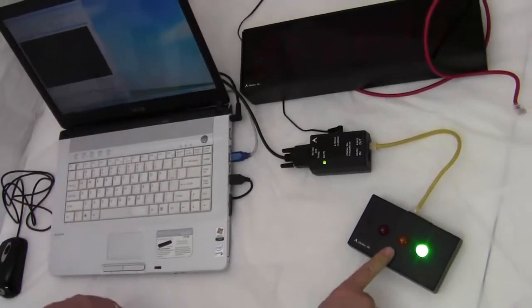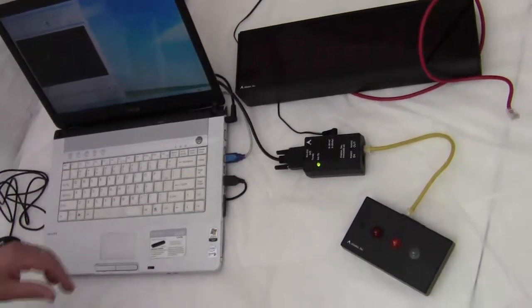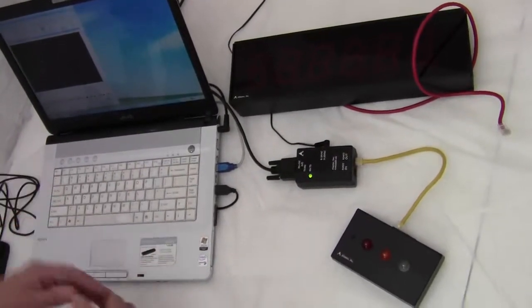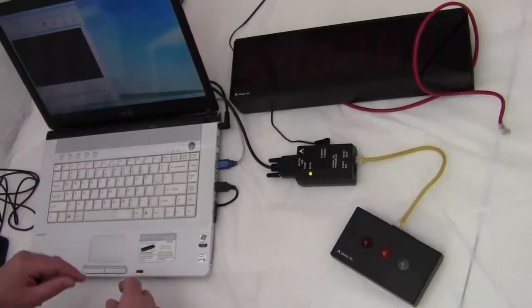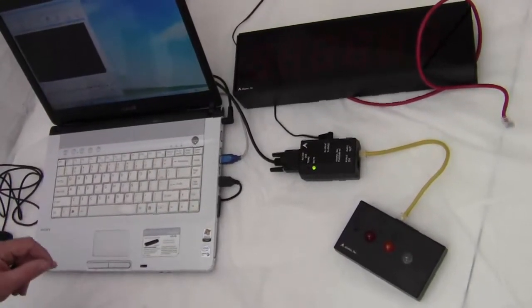Now the beeper is kind of a long beep. If I want to shorten it, to have the beeper on for half a second or a second, or whatever time period I want, I can send a command right after it, within a second, to turn off the beep. So RLY lowercase p turns on the beep, RLY and any other command will turn off the beep.